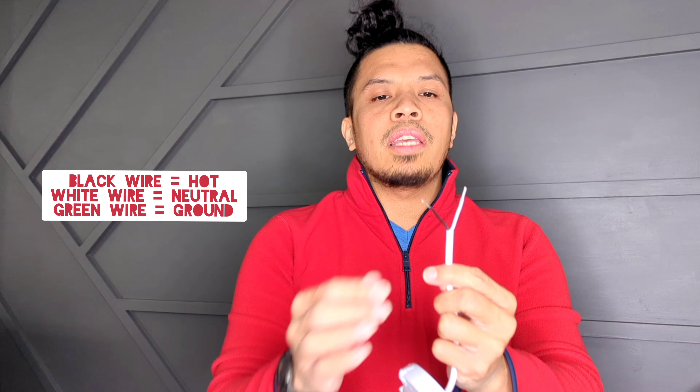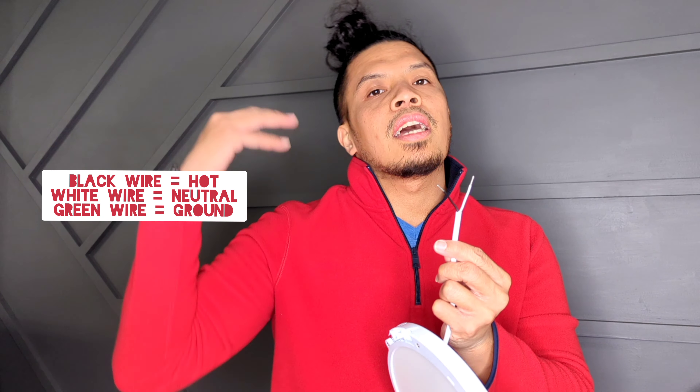You also have the wiring here. This light only has black and white wires and apparently our ceiling wires have the same colors, so I'll show you how to connect them. I noticed that the included connector only accepts short wiring, so if there's excess wire I have to cut it. Instead I'll be using a wire cap and twisting the wires together.